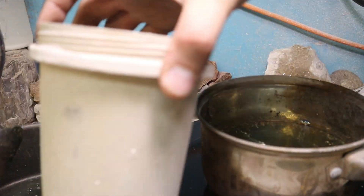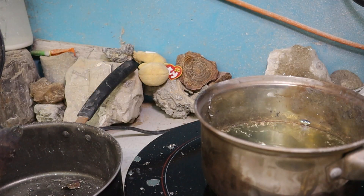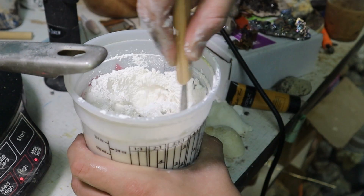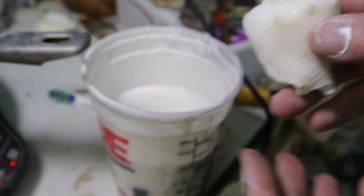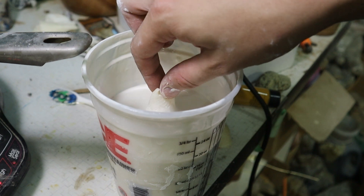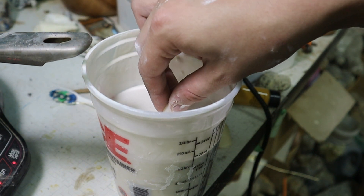All that being said, I'm going to wash this container because it's actually like the perfect size. I'll go grab some plaster of paris and I'll be right back. Now we're just going to add water — I don't think I have enough here, yeah definitely not. Once we have it mixed up, we're going to take this wax shell and once it starts to set up a little bit we're going to just poke it down right in there. It's going to be floating for now, but I'll keep close tabs on it and as soon as it starts to set up we'll get it dipped in there.